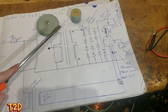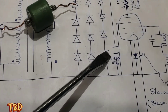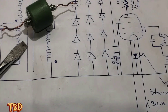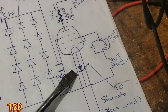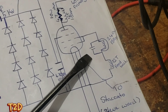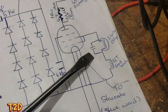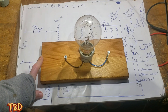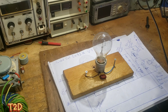Next, the capacitor across the diodes calls for a 470 pico 15 kV capacitor - I'm going to use this Soviet doorknob capacitor which happens to be the same rating. There's also an SCR which is there to interrupt the ground connection when we want to use staccato operation. Next we have a 240 volt 150 watt tungsten lamp, and in parallel with this lamp we have an 8 nanofarad 1500 volt capacitor. We just need to attach that capacitor across the two lamp terminals.